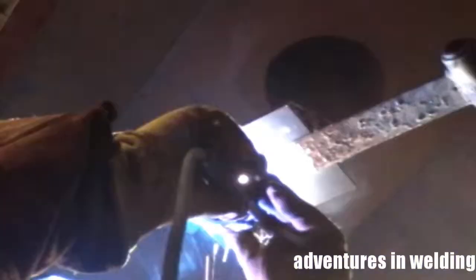I've got the camera laying down flat on the table looking straight up overhead at the weld. The flash will be gone in a second — this gives you more of an idea of the hand motion: towards and away from me, towards and away, as we slowly work our way down the plate. I am wearing full leathers here because you're going to have hot, smoky, melty bits flying all over you and you don't want to be jumping when they hit you.